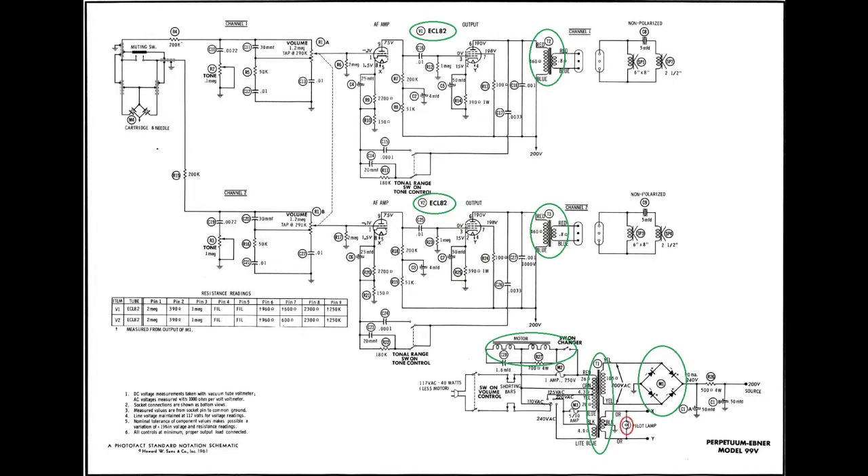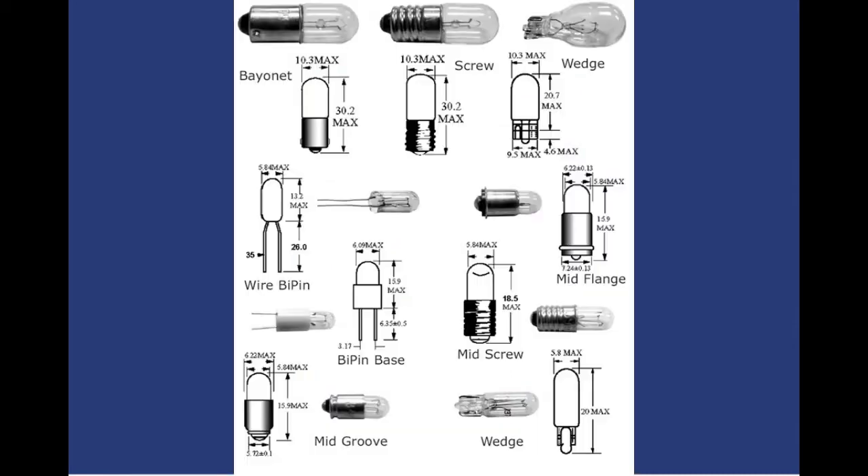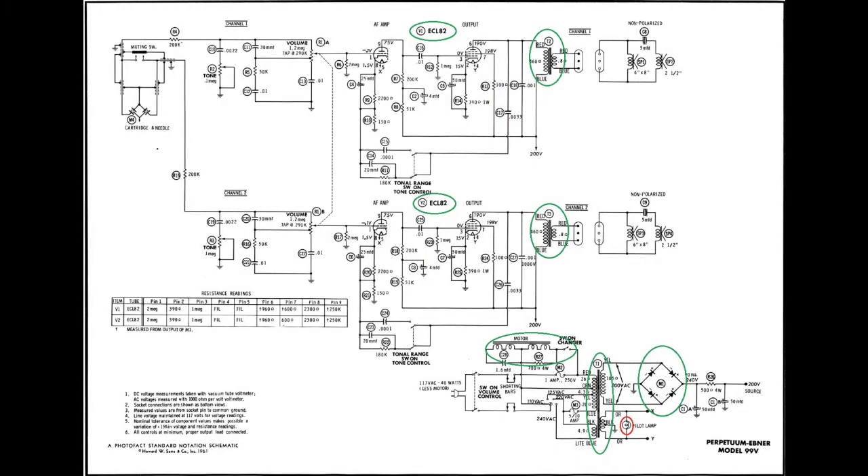The pilot light and its cover were long gone, as I only have the vaguest of memories of them ever being present — looks like another part to add to my unobtainium list. I did find a 6.3-volt bulb that just might fit, but they were $6 each plus $14 shipping US, so I'll have to figure out something for that later. The 50 microfarad twin can electrolytic was discolored and just beginning to leak, so that one is toast. The temperature gradient in the attic — from below minus 20°C to well over plus 40°C — was simply too much for it, so that one's going to have to be replaced.